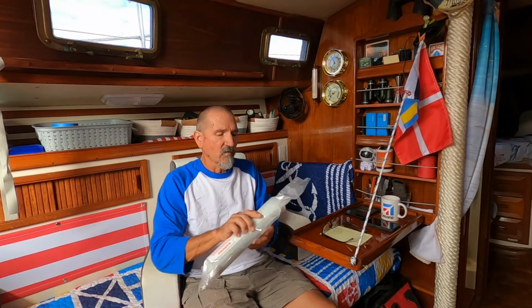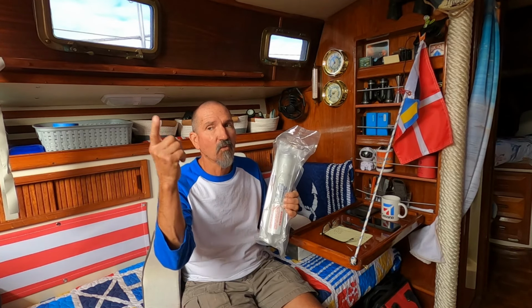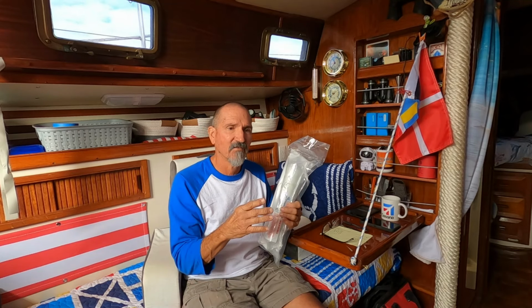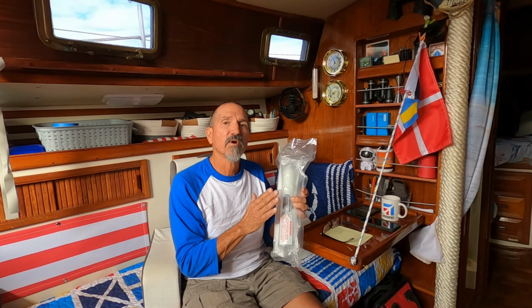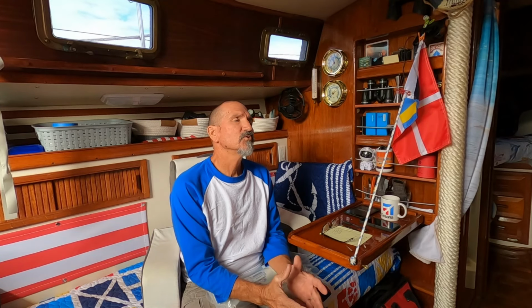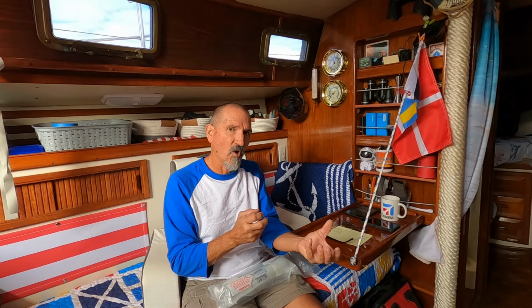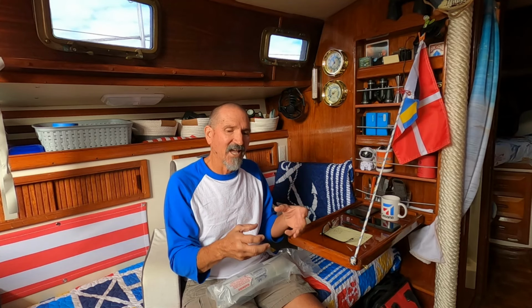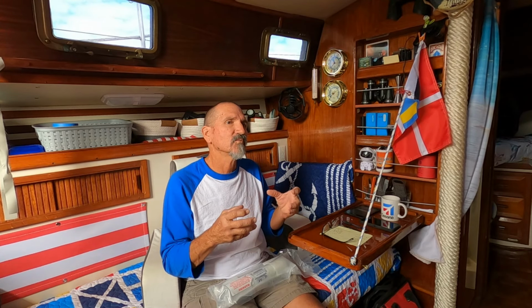And also, this is based on an element that they call a 2514, which has to do more with the size of the pressure vessel, actually. It's a 2.5 inch diameter by 14 inches long pressure vessel. People have used the 2521s, okay? And you might get a little bit more flow, but you tend to do a thing that is called overrunning the element. There's a certain ratio between brine to fresh that you want to adhere to for the best life expectancy of the element. And the 2514 size is really the best size for this.